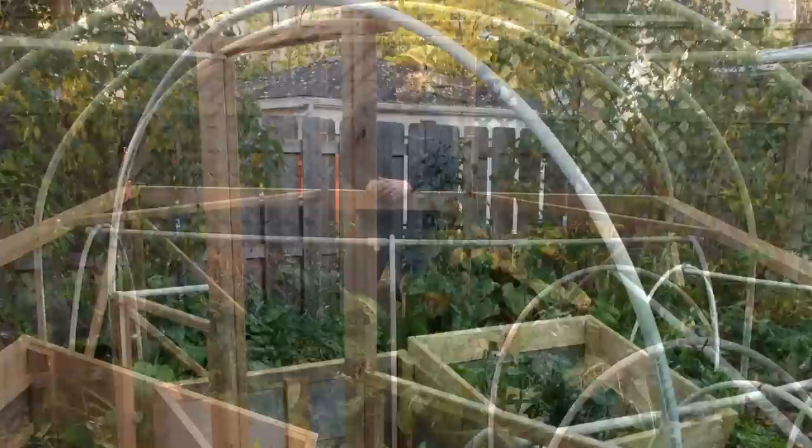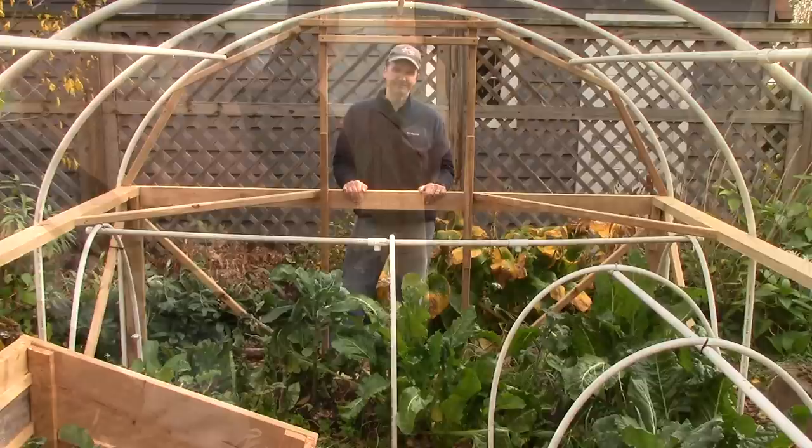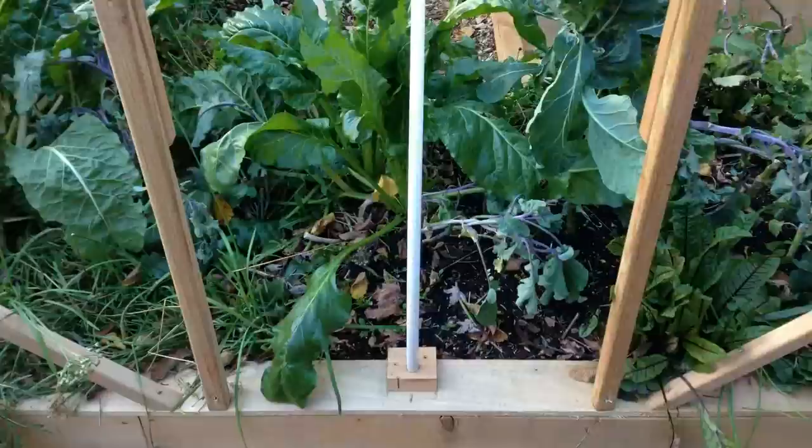After completing the west end wall, it was time to move on to the east end wall. Construction of the corner posts and diagonal bracing was exactly the same, so I'll skip that and move ahead to when I installed this 2x4. I cut the 2x4 to length and notched out both ends so it would fit nicely onto the corner posts. I left enough space on the ends to accommodate the sidewall framing. I installed two 2x2s to support the 2x4.